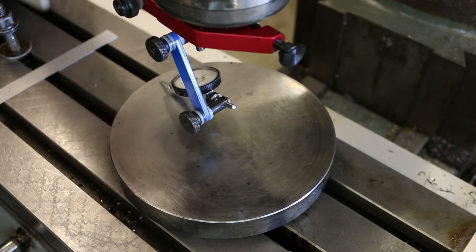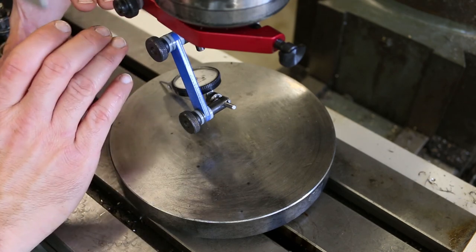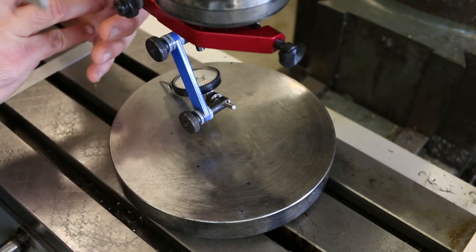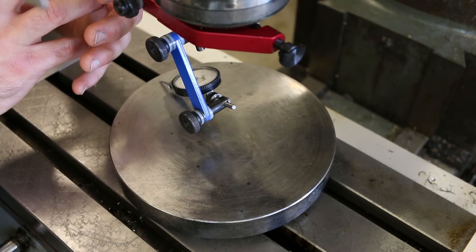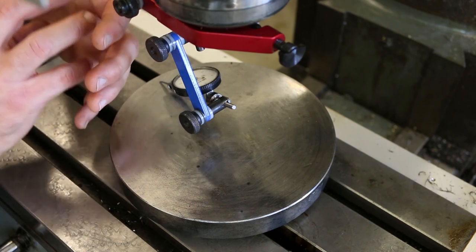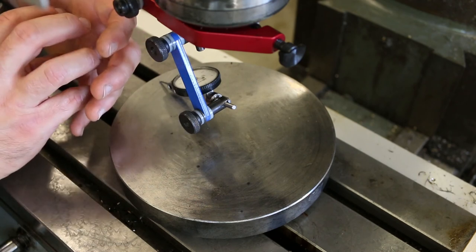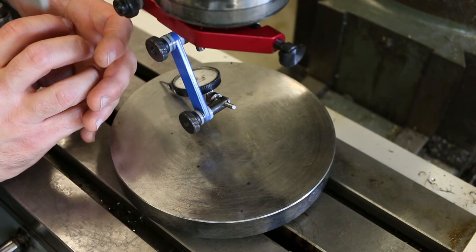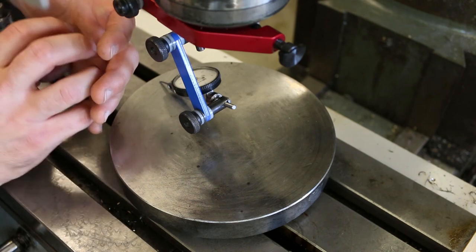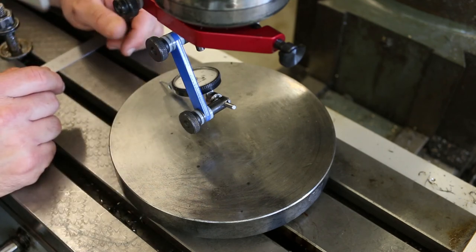What can happen with this head is that the register that the head is sitting in is like two diameters, an internal diameter and an external diameter, that fit closely to one another, and that's what forms the actual pivot. Well, if there's any slop or clearance between them, when you change directions, it's not a purely rotative movement. It can actually shift slightly inside of the clearance, and that's actually what happened here. And it can happen, and it does happen.